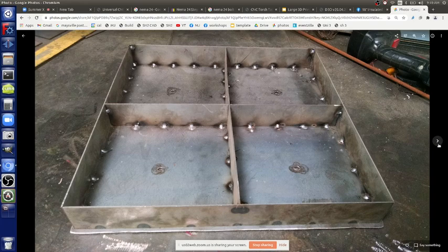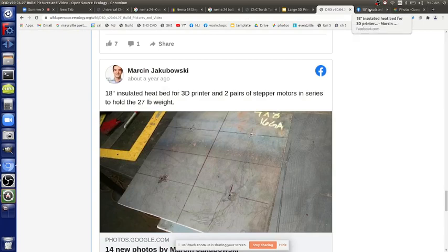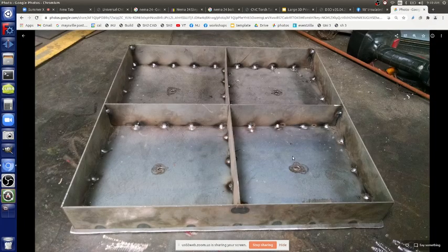Regarding warpage: when welding, you hold down the bars — stock material, two by 1/16-inch lightweight stock — really flat. That edge is quite straight, within about a millimeter, so you'll have millimeter flatness across the whole thing as long as you tack-weld it. Just use dots — that's plenty strong. If you burn a lot into sheet steel it warps, so just weld in dots.